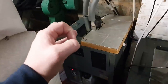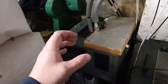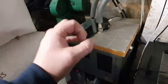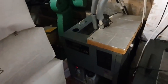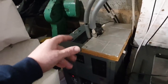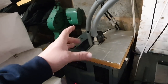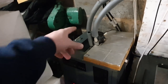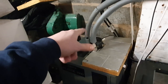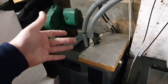That means that the machine thinks it's at temperature, so it's going to turn off, because the thermoprobe is encapsulated in ice, so it can't go much higher or lower. Ice is an insulator. So this would have just been pumping and pumping and creating more and more ice, which prevents the liquid from getting cold, which means the liquid going through the pipework wasn't getting colder. In fact, it was getting warmer because it was taking the heat out of the cold room, like a negative feedback loop. It makes this worse.